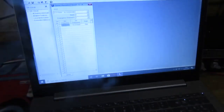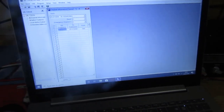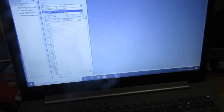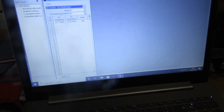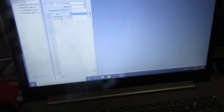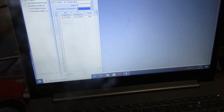I'm not going to do anything on this screen here because it's already tuned to what I want, and I don't want to be typing in all my frequencies again. So once you've wide-banded your radio with that button, that's when you can click on your second option in the software — 25.615 to 30.105 — and then you can type in all your different frequencies. Here is where you choose your different bands, and then you choose your emergency channel as well.